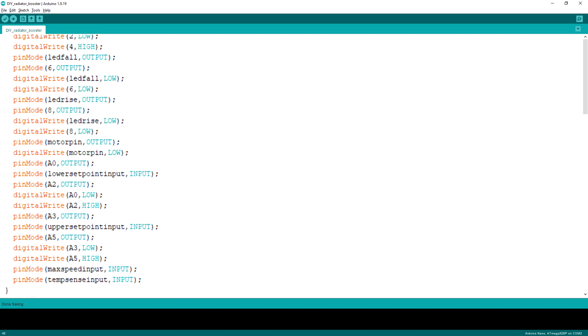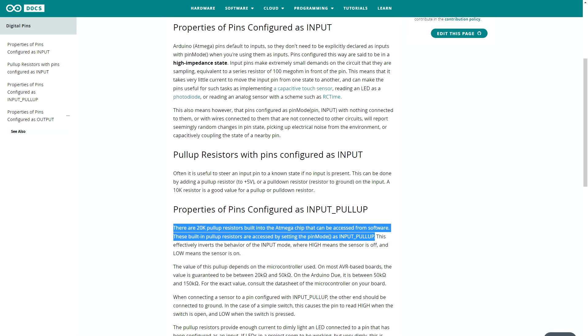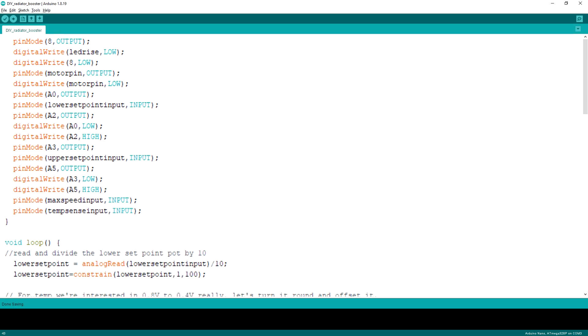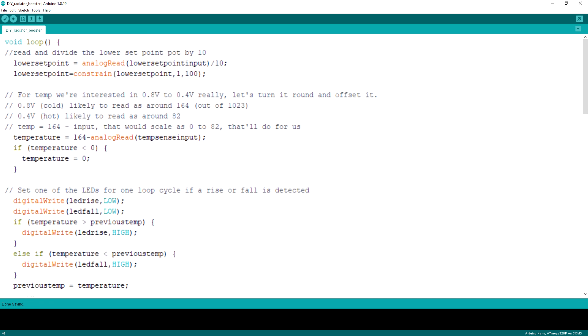Right at the end of the list, you can see that the temperature sensor input is set as an input. Now, for a lot of the analog inputs, you can enable a built-in pull-up resistor. Remember the 20k resistor I was testing with earlier? That's why I chose it. Unfortunately, that's not the case for pins A6 and A7 — these have no output capability and therefore no pull-up capability, because it uses the same circuitry. So I've had to bodge this from the 5V presented by pin A5. The last section is the loop routine — this bit just keeps on running in a loop, hence the name. All the bits with double slashes at the start are just comments, which don't find their way into the Arduino, and they're just there to make the code easier to understand.